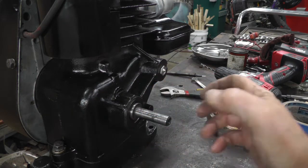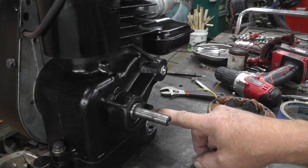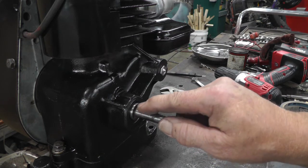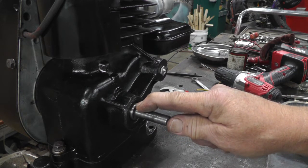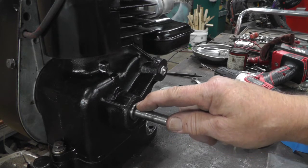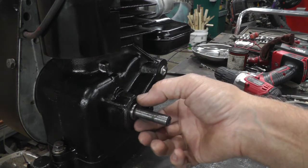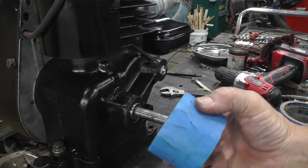And then once I get that one in place, I'll go ahead and do the same with the one down here. And then once I get that done, this is 7/8, so I'll drill a 1/2-inch hole out to 7/8. And if it rubs, I could make it 15/16 or something a little bigger. So I'll have 2 bolts here. This will be centered on there. And then once I get that plate mounted, this will go in place.